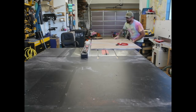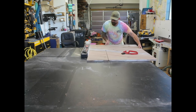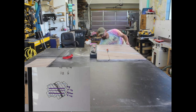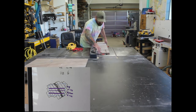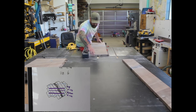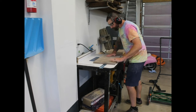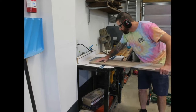Now that my panel is complete, I can start cutting the stair pieces in orientation. First is the top step, then I'll rotate the blade 45 degrees to get the top riser. Flip the board over and get the bottom riser, then come back and hit the other 45 degrees on the bottom step. While these pieces are all separate, I'll put a round-over on the parts that make sense.